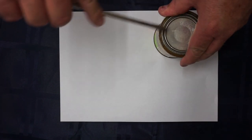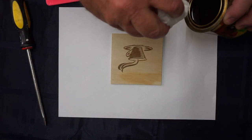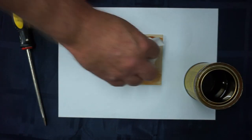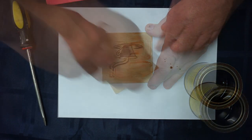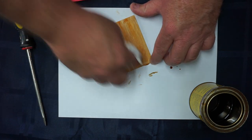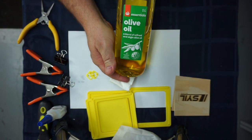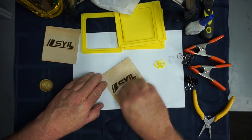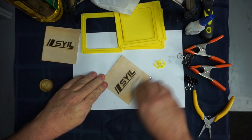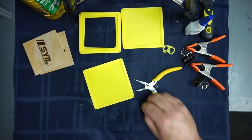You may want to protect your timber somehow. I used 3mm ply when I laser engraved mine, and I had some old wattle stain which I just applied with a tissue — to be honest I didn't have any brushes at home, having run out after doing lots of painting on my tool and cutter grinder. I applied it delicately in the direction of the grain. If you want something more low-VOC, don't be afraid to use cooking oil like canola or olive oil — it won't have the longevity of stain but it's safer if you're worried about chemicals.